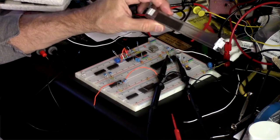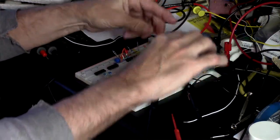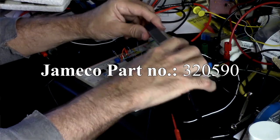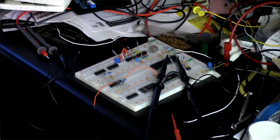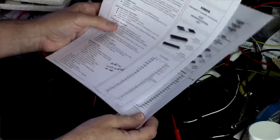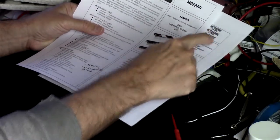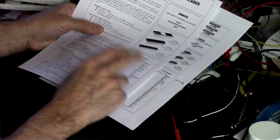Today we're looking at these processor chips I got from Jameco, and they are marked as what I ordered, which is, I don't think you can see that, MC68B09E. Now, there are two versions of the 6809 processor, in different speed levels. The A and B levels just indicate the speed. But there's a 6809 and there's a 6809E. The difference is that the E requires an external clock and the regular 09 has an on-chip clock generator.